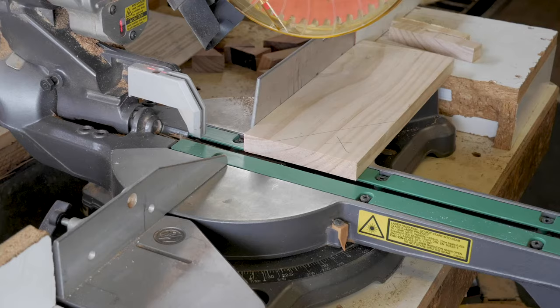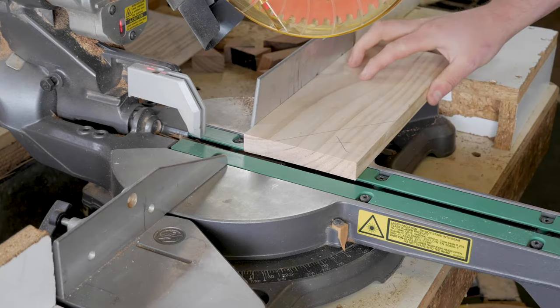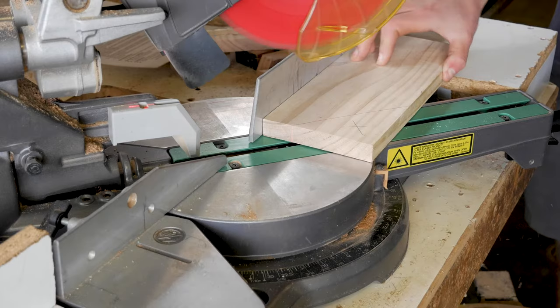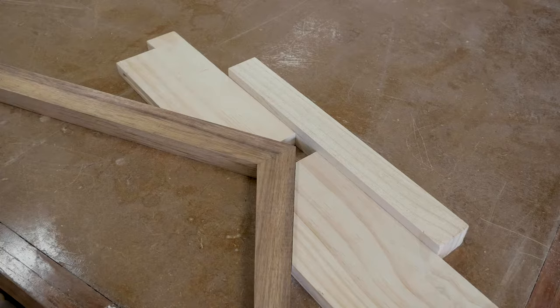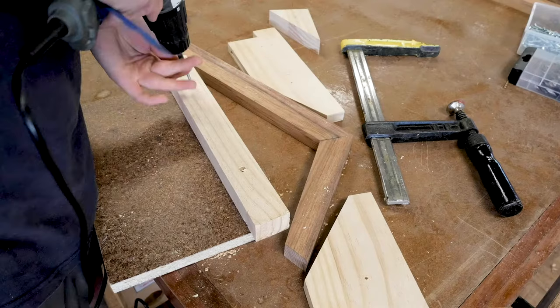There are two types of jigs I'm going to show you. This first one is a little bit more complicated — it requires two points to anchor. The second jig I'll show you later is just one point and adjusts a lot easier. I recommend just using the drop saw; it's going to be the easiest thing to cut a straight line on over a bandsaw or scroll saw. It'll create a nice form — you get a wedge, and you can see the corner of the joint at the top of the leg is not getting crushed, that's why there's a bit of a gap.